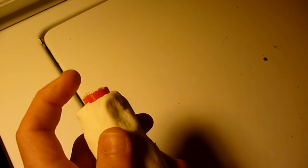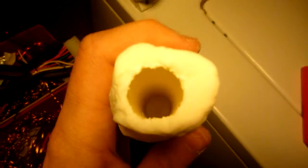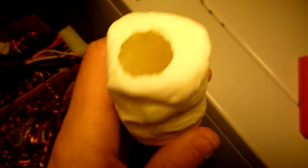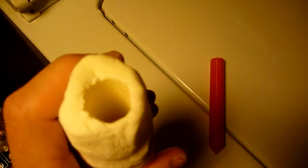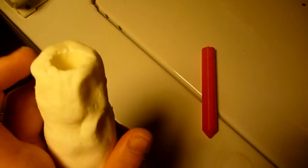The mold is finished. I just have to take the 3D printed part out and put magnetite and epoxy inside. My mold has finished curing. As you can see, it turned out pretty nice — the walls are nice and straight. I just have to make my magnetite and epoxy mix and put it inside.